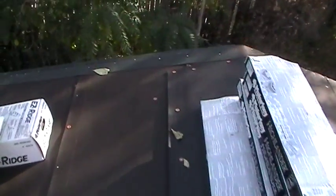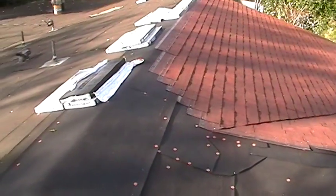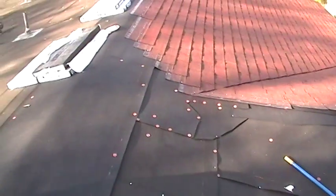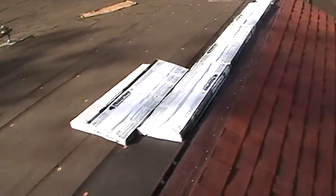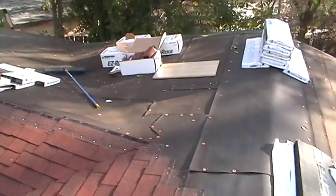Here's a heads up on the starter stuff. They sent me one box — theoretically supposed to cover a 1,500 square foot house, but they miscalculated by a long shot. Split in half, it only equals 36 pieces, 36 inches long. It was enough to do the front of the house but not the back. So I'm going to need another box of starter shingles, or I can make my own by cutting half off — but I think that's going to be a lot of work, so I'm probably just going to get another box. Maybe return those ridge cap ones and work something out.